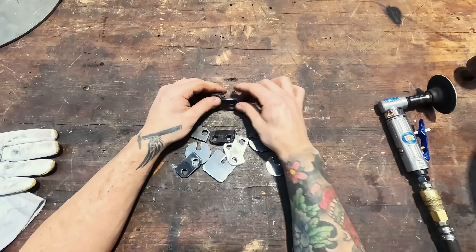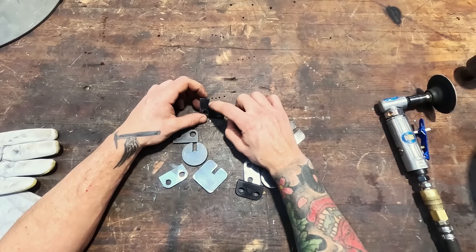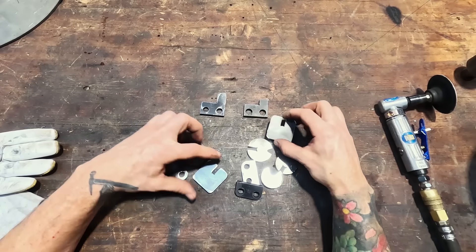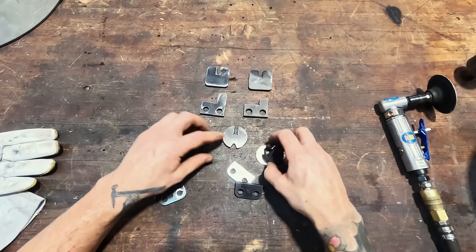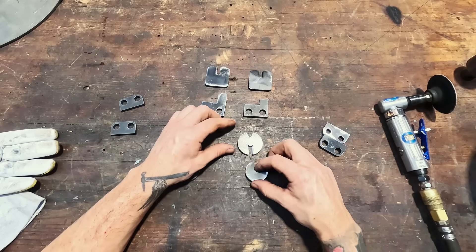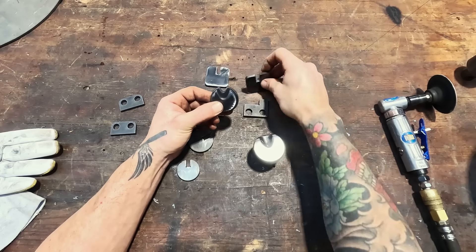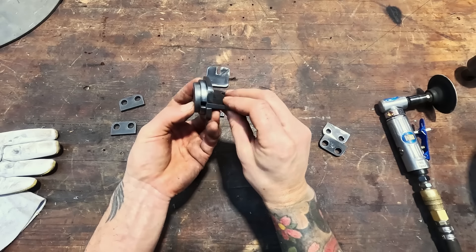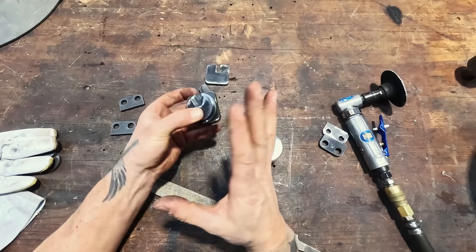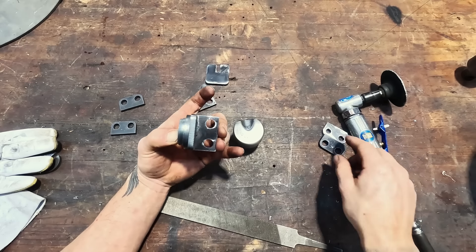How does this go together? We've got a few different pieces here. We've got this little bit longer L shape that is for the thumbnail on the lower die, and this one here is for the upper die — it's a little bit shorter than the thumbnail. These two pieces are the same. We've got two different size circles and then four pieces that are all the same. These two different size circles are designed to stack — this creates the area for the thumbnail. Underneath that is this piece, and the shorter piece tabs in here. All these little steps are areas to weld, and by the time it's all welded and ground it should look like this.